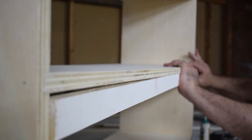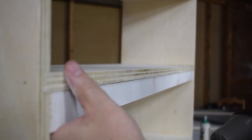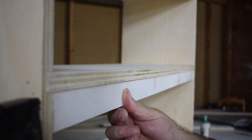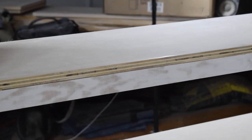Not bad. Once that glue dried, they were super stable already. I decided to add a piece on the back — just cut strips, put some glue on it, and nailed them into place to hold it while the glue dried. There were a couple of reasons for this: it's going to add stability to the back of the shelf to keep it from sagging, and it gives me a place to run screws into the wall to hold the shelves more securely. I did that on every shelf.